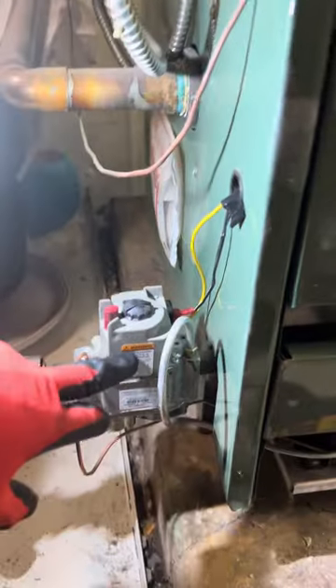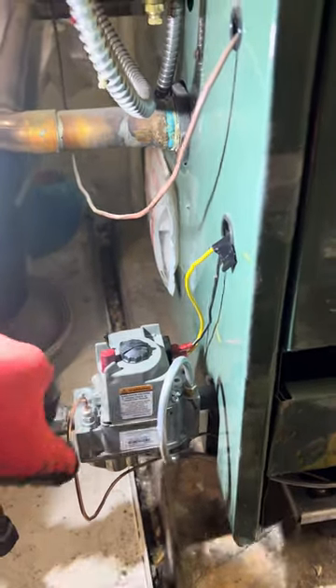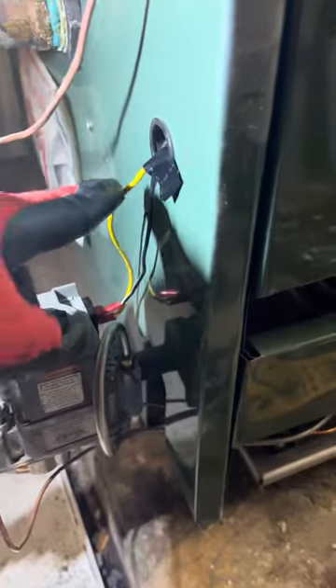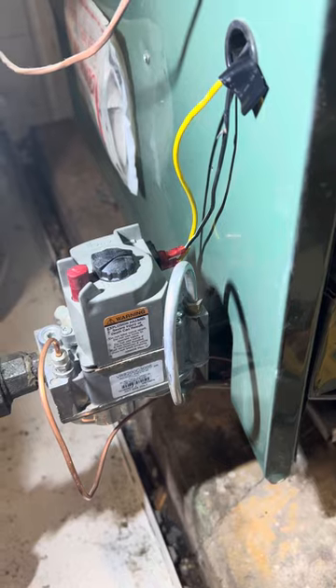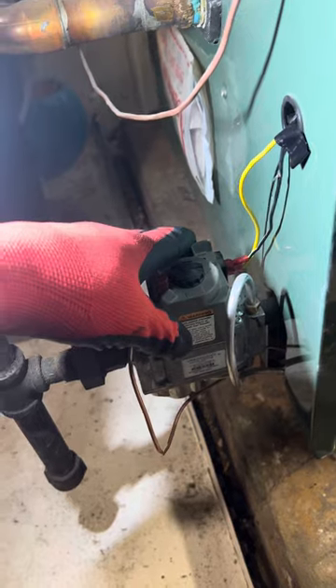What I got going on is a solenoid in here is buzzing once the solenoid closes for the gas valve. So watch here. Got a damper opening up, got a new gas valve right there. I checked it before — we have 24 volts. It's scraped a little bit off. So we got 24 volts here and here. You hear that noise? The high is 24 volts, it's not too high, it's not too low. You should check for that. If you're low in voltage or high in voltage, you might make this thing chatter, especially if it's low in voltage.